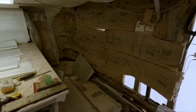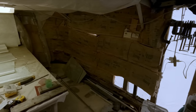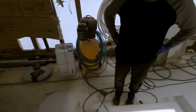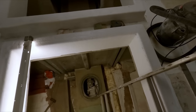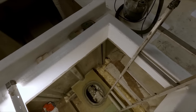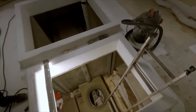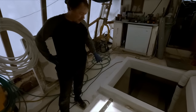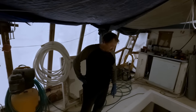Oh yeah, the other exciting part is laminations from over there are all gone. Just one little piece of straight up laminated sheet to go over this foam void over here. You can see the grinded off outline. That's where it will receive that piece of lamination. We'll fill in that void with foam, and have a nice flat area there. Be nice and flat and easy. So yeah.